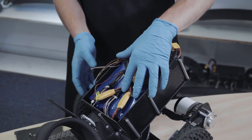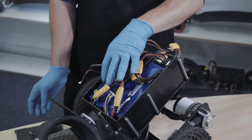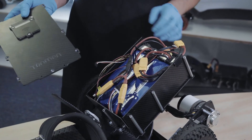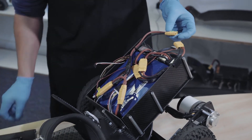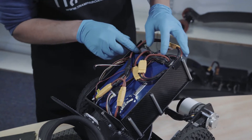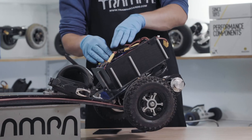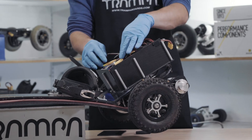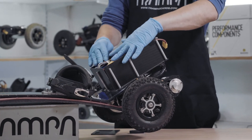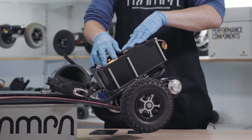These are your two battery connectors here. That should all be connected now bar the receiver, Bluetooth, and the LCD screen attached to the top of the box. We can just power this on and visually check the VESC — we've got blue lights. I can see two blue lights there. Everything's working, everything's powered up, and we can move on with getting the top of the box on. Everything's in, it's all connected. We just need to make sure everything's flat.